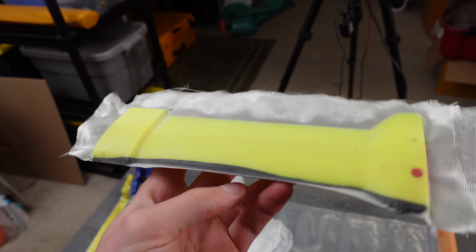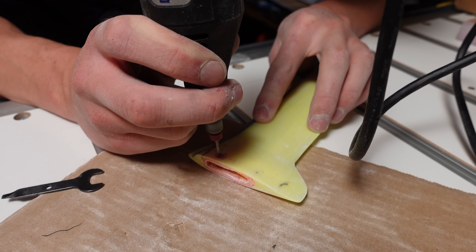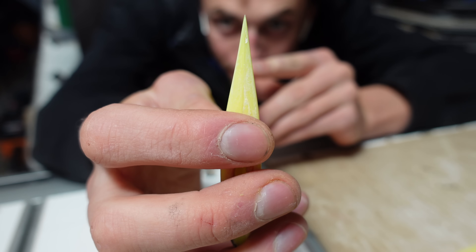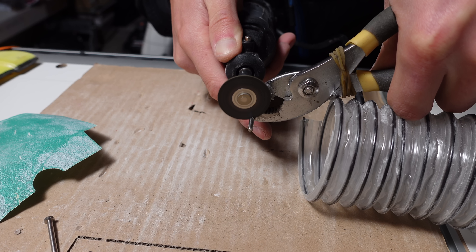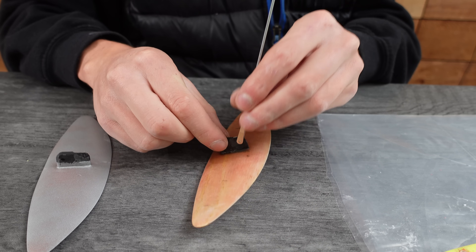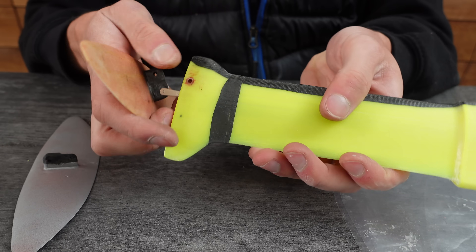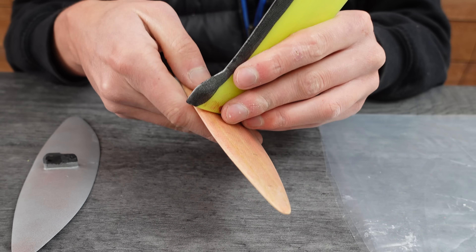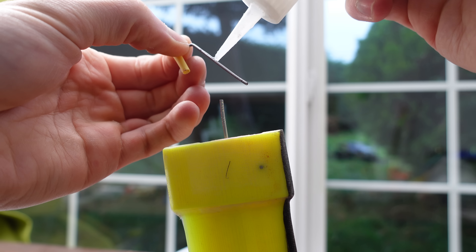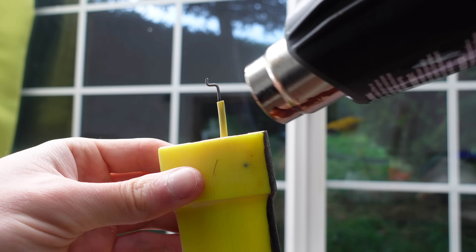I got to work cleaning them up and sanding them down. I used a little end mill on my Dremel to cut back the fiberglass over the pivot hole. The trailing edge on these is super sharp for maximum hydrodynamicness. I then cut some M3 shoulder bolts from the Snowcat project to make little pins for the pivot. I connected push rods and threaded them up through the vertical parts, popped a pin in there, and you have quantity 1 active hydrofoil — pretty freaking awesome. Then I put a thinner rod on top of the push rod to interface with the servo, and held it on with super glue and heat shrink.